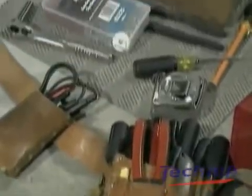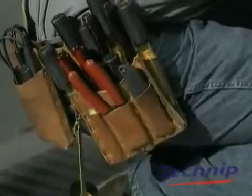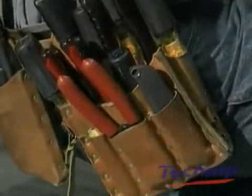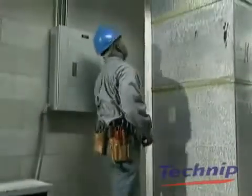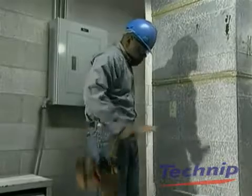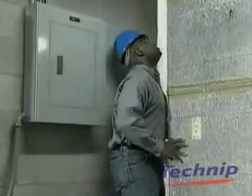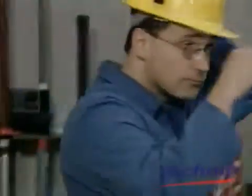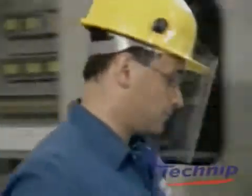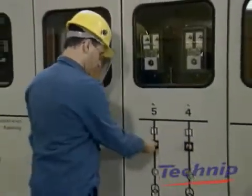Tool belts are practical. However, metallic mounts, rivets and tools make the belt unsuitable for work in small areas, as they may come into contact with live surfaces. The belt should be removed before beginning to work in confined spaces. A non-conductive helmet protects you against electric shocks, combustions and falling and moving objects. If you are working near live circuits, you should also protect your face.